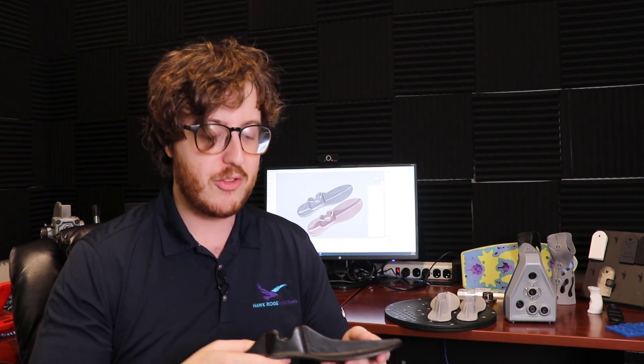This shoe insert does have some wear. It's made of cast iron, and we see this a lot with molding: if a tooling has been used quite a lot, it's going to get naturally cut up and dented. And if you only have one available, you're going to want to make sure it's archived or digitized before it completely wears down so you can reproduce it. Because it is a little heavier and does have that casting, we're going to want to remove a lot of this before we actually send it to the printer.